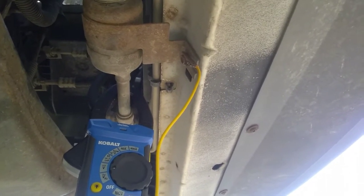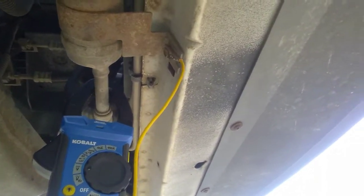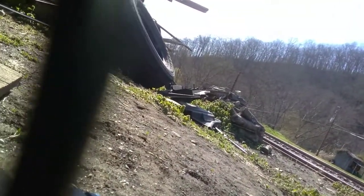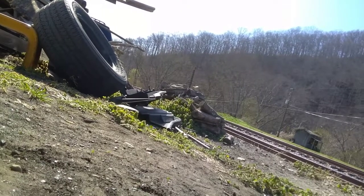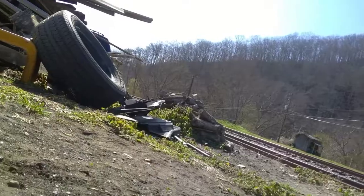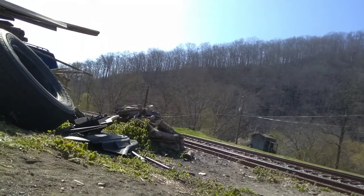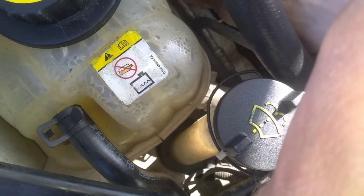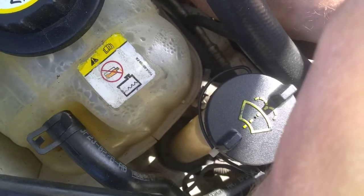That lets me know our sensor is good. And that first test I did with the low pressure switch lets me know that low pressure switch is bad. It's a normally closed switch — if pressure gets too low, the switch opens up to protect the compressor. Our refrigerant is good, our compressor is good, we have no restrictions, so until I can get a replacement switch I need to jump out that low pressure switch. I can do that because this is just a normally closed switch, not a transducer. You cannot jump out a pressure transducer — you'll short it out and burn out the engine computer.